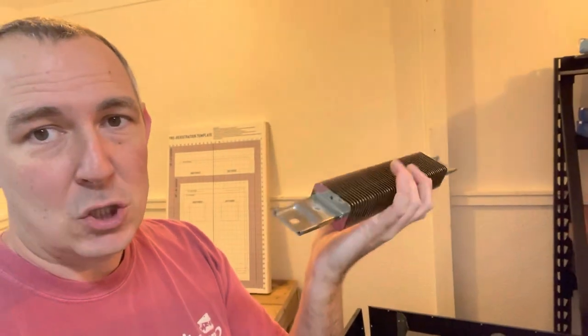Happy Friday guys. Yesterday we were working on this drying cabinet issue — this is not heating up. It was really hard for us to dry our screens yesterday. We ended up buying a hairdryer and putting it into the old one, and that actually works pretty well. Workhorse, the company that makes this drying cabinet, overnighted a relay to us. I got that put in, but that did not solve our issue. We realized it's working and blowing air, but it's just blowing cold air — the heat was not going up. So we've taken out the heater. There's a little heating element inside the unit, and Workhorse is overnighting one to us, so hopefully that will get here today and we can get it installed.